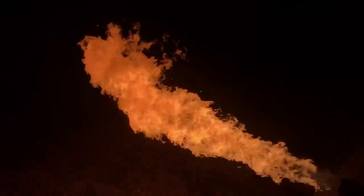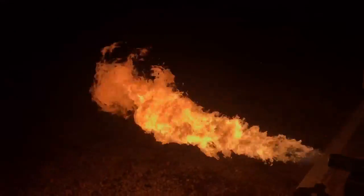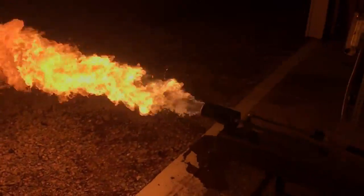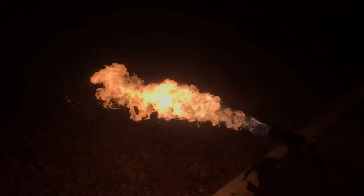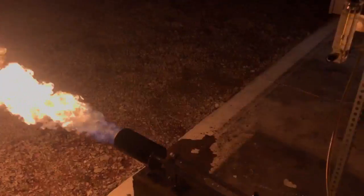This flame's looking beautiful. Let's crank this thing up and see what it does with some more secondary air. This is probably about 500 horsepower worth of fire there. We had a little flame out — an air bubble did that actually. We'll show you that here in a second, what an air bubble can actually do to you.